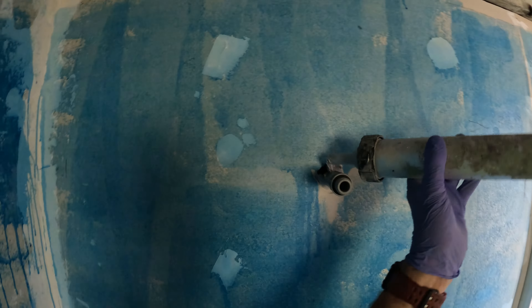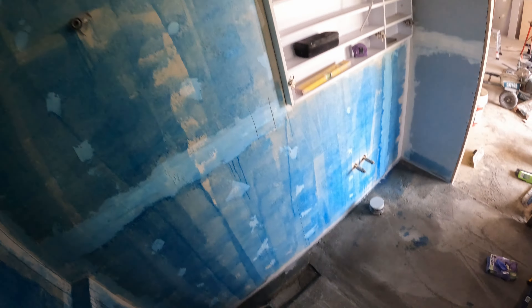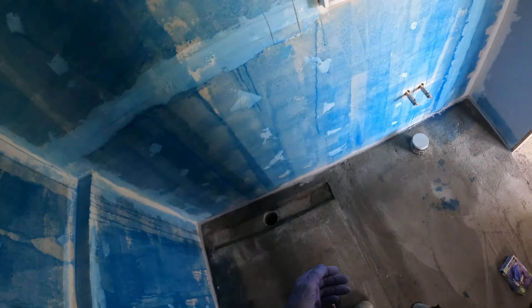Seal up around your pipes. The reason for this, everyone, is because when your taps are on, water — especially on this one or that one too — you have a cover plate and your wall's getting wet because you're washing your hair. The tap actually sucks the water in behind the cover plate. If that's not waterproof, water gets sucked in behind your wall and runs down the framing. And people think they've got a leaking shower — yes they have, but it's not the waterproof that's broken down, it's that letting the water in. So just be mindful of that.